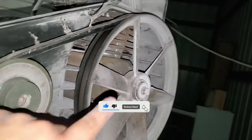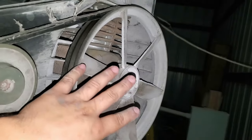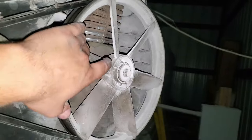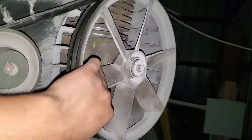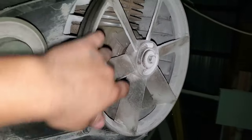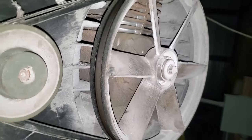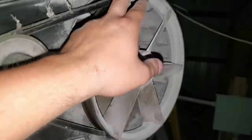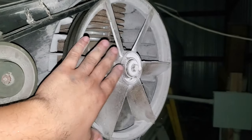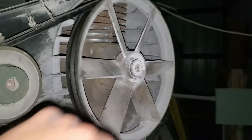For a moment I thought maybe my air pump was seizing up, but I had good oil and everything. When I took this cover off, I turned the pump and I can tell that it's free — it's not seized up in any way, which is a good sign. That means the piston inside and everything is in good operation, so a seized pump is not your problem.